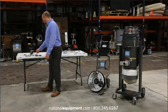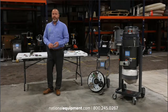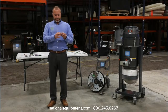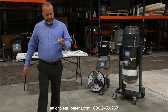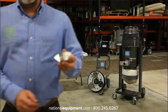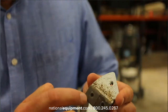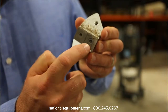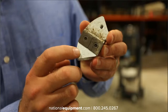And so, slightly less aggressive than the PCDs that we've been talking about. The carbide chip has 4 different sides on it. So for ours, our carbide chip is just this little segment. And you actually get 2 of them per tooling holder. And I can talk about the tooling holder later so we understand its purpose.